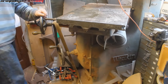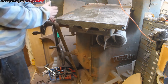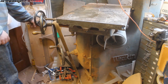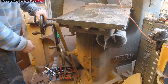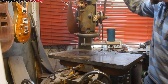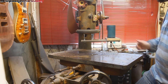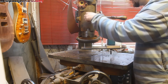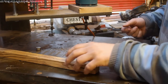This is an old Wadkin machine. I'm not entirely sure what it was actually called to start with, but basically it acts the same as a milling machine with a three-axis table. Using these beautiful wheels I can move this table left, right, backwards, forwards, and up and down. I can also move the router itself, either with this handle or with a foot pedal, and this is the beautiful thing — you can lock that off and say, OK, I want to cut that much material away. There are several things you can do with this.